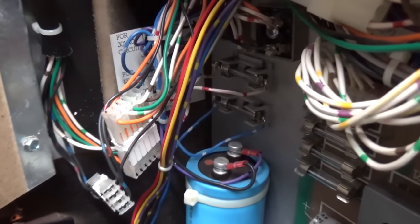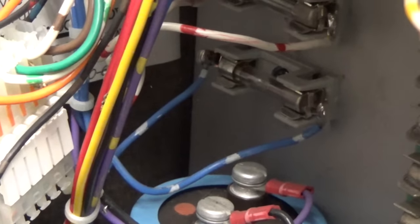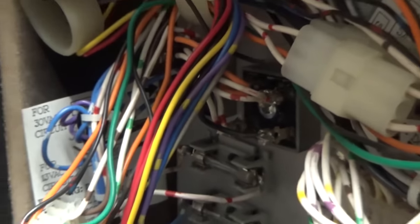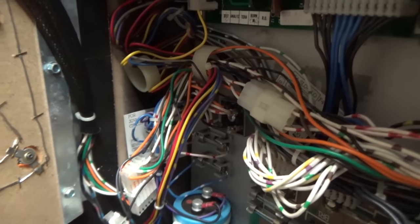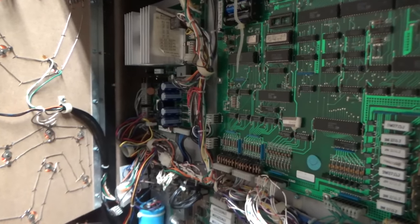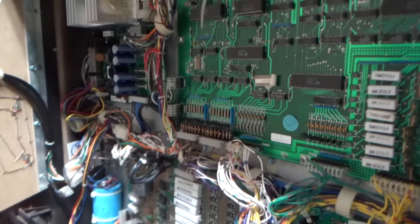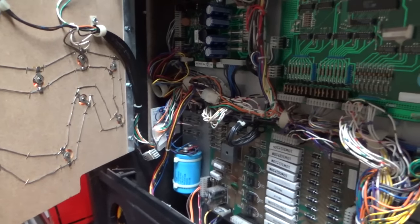Sometimes there's a reason a fuse blows. These two fuses over here run off of bridge rectifiers. The fuse that's blown is the bottom one with the blue and white wire. It's this other one hidden behind all these wires. I'm going to show you how to test the bridge rectifier and see if it's blown or still good — it may just be that the fuse blew. This thing had several blown fuses on the previous video, likely because as the voltage dropped and the board started resetting, it may have locked some stuff on, which blows fuses.